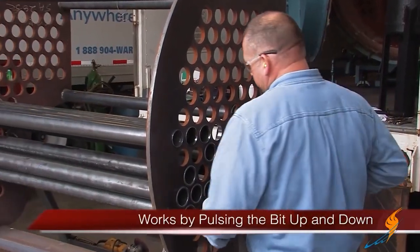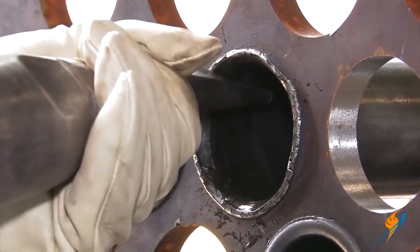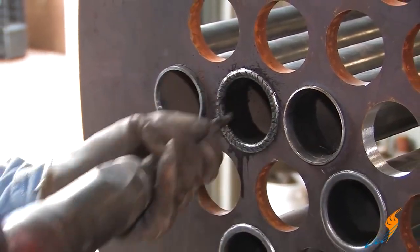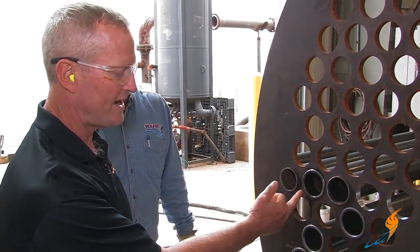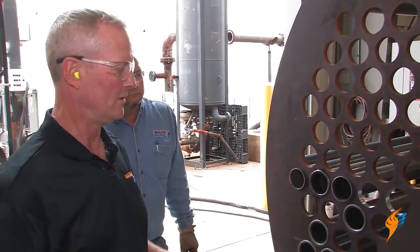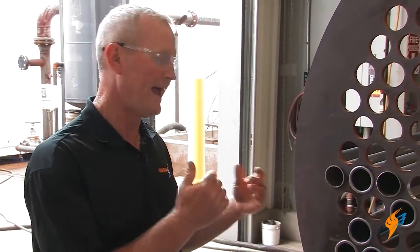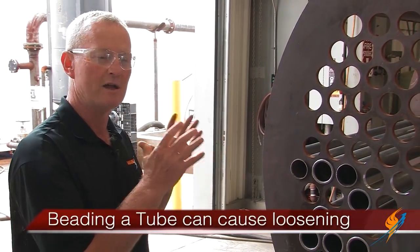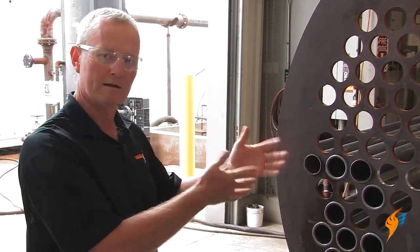Now we move on to actually beading the end of that tube. This is a special tool they use, and they'll form these themselves to get the right curvature. They use a little air hammer to do it — it's a technique that requires a lot of skill and arm strength. Towards the end you saw Jimmy going around pretty fast — that's how you get that smooth surface. If you went real slow, you'd have jags in it. Jimmy's done that a lot of times — it's a perfect beaded tube. The last thing is to touch it up with the Collins straight roll, since beading can loosen the tube slightly. After that, the tube is done and sealed up.